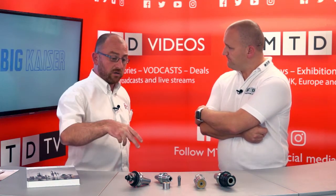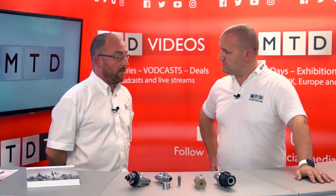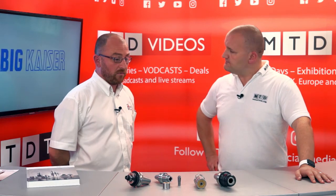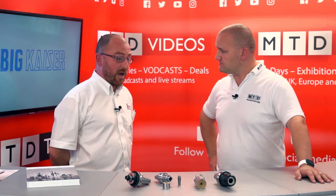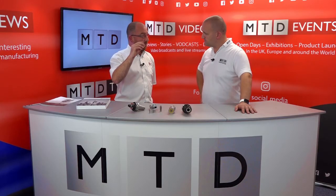Everything on these collet chucks is hand checked for run out. On these two particular ones here, they guarantee a 3 micron run out at 4 times diameter, whether it be a mill or a drill. Okay, and a similar scenario on the high performance chuck. Yeah, that's a roughing tool, but it achieves a better run out than you get from a standard ER collet setup, even though it's for roughing. So for roughing, where's the advantage? Is it down to tool life again? Tool life and the fact that it's held in a much stronger position. The standard collets that we have are a 12 degree, whereas a standard ER collet is an 8 degree. This means that you hold on much more of the tool.